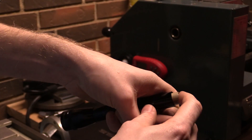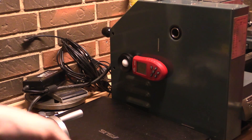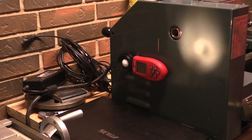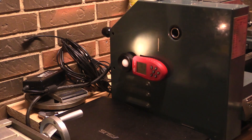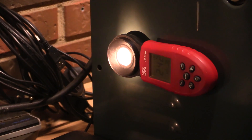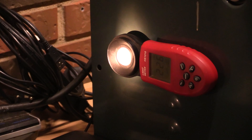As you can see, they barely fit in here, but it's working. I'll start my timer watch again when I get this screwed on. It looks like I may have bumped the focus a little bit, so I'll turn it on and put it back in the fixture. It's pretty much similar to what we had before — we got 2400 lux when we begin, so I'll note that down. It is dropping a little bit, as you would expect, because it only starts to regulate once the battery drops below 1.5 volts.